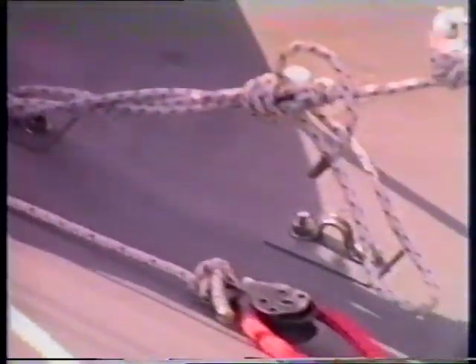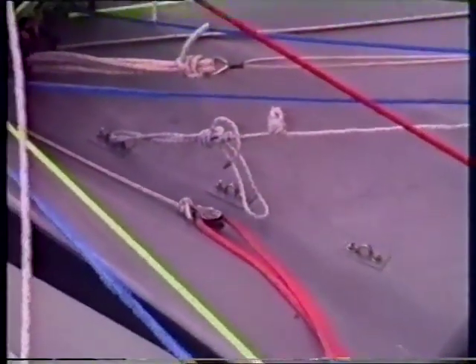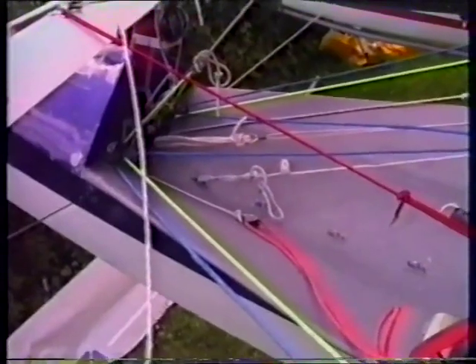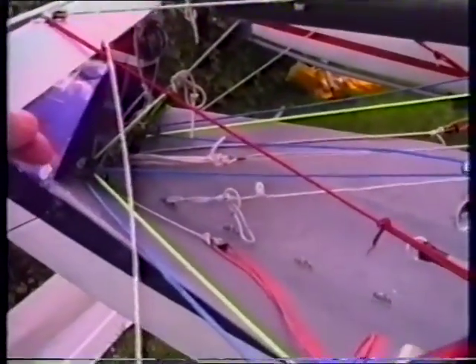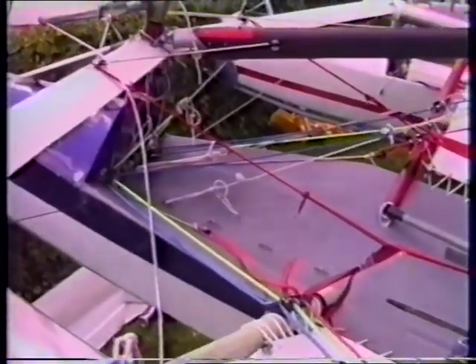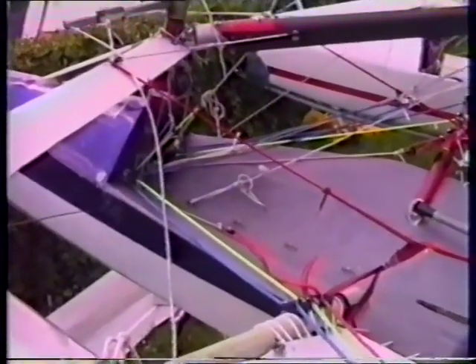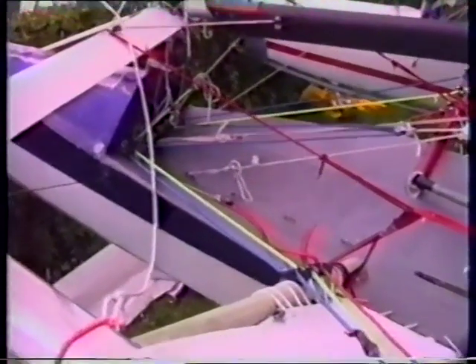You can see here that he's got three take-off points — one there, one there, and one there. Depending on the angle of his mast, as the boom swings across, you can allow the vang to ease out. If you just move the boom out again, you'll see how, as it comes across centre, pivoting from a different point, it actually eases the vang as it comes in towards the centre of the boat. And if you were to move it further aft, it would ease it even further.